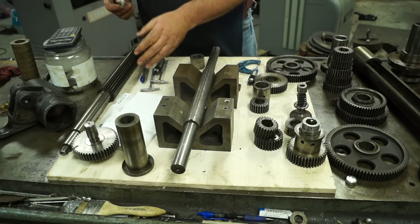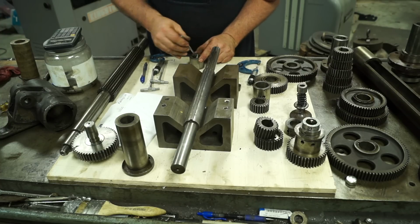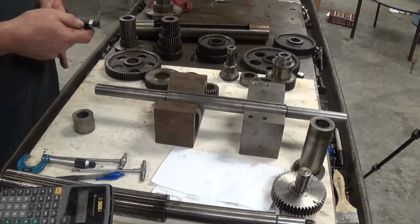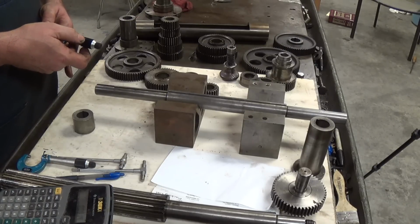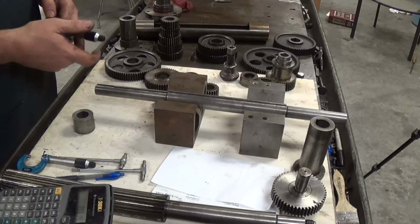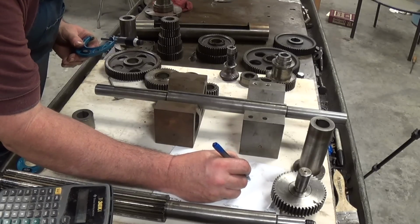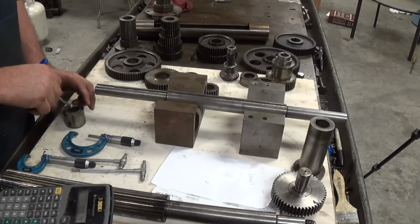Let's get our piece of paper and we'll turn it over. Alright, down here we have on this bearing, and I'm going to have to break out the 1 inch. That's what that is, a 1 inch shaft. Alright, on this bearing here we have 1 inch and 2 7/10. So we have 1.0027. Okay. And check it again, like I said, check it 90 degrees.